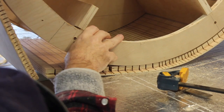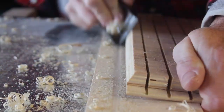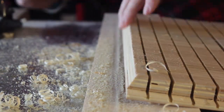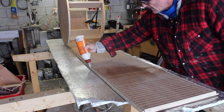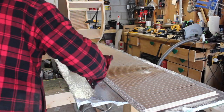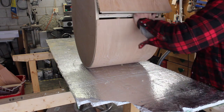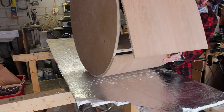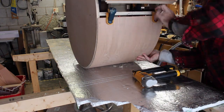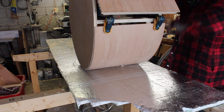So I did a little dry fit here — it was too long. This was an 8-foot sheet of plywood, and I did make the diameter such that it wouldn't go beyond the 8 feet. But I knew I would have a seam here, so what I did is I left it a little bit short so I could fill it with a piece of hardwood that I had glued up, and the grain would generally match it. So here I am doing the glue-up — this was an exciting point in the project. I'm kind of rolling it down to get it started. I had it loosely clamped on there to get it started, now I'm adding in the clamps, and I'm also going to tack it in with a brad nailer, just trying to make sure that it's perfectly flush on the top, and I'm okay with it being just a little bit past on the bottom.